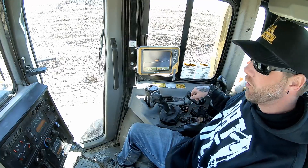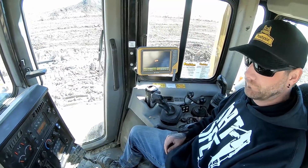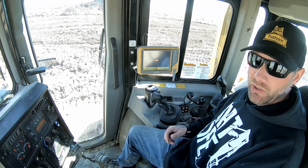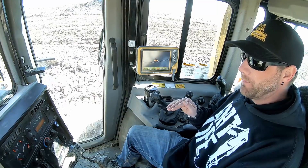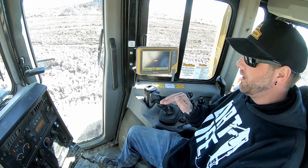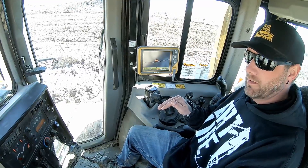I'm in the cut. I'm going to turn the auto on and see what happens. It's not doing anything. What the dozer is doing right now — I began with my blade down pushing, and the dozer doesn't know what's going on, doesn't know the terrain that it's on or around. Going ahead, the blade isn't lifting, it just keeps digging. That's not really working. Let's change to the other view and you'll see what I mean.